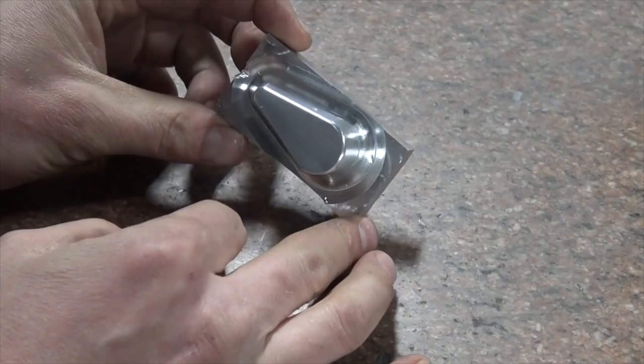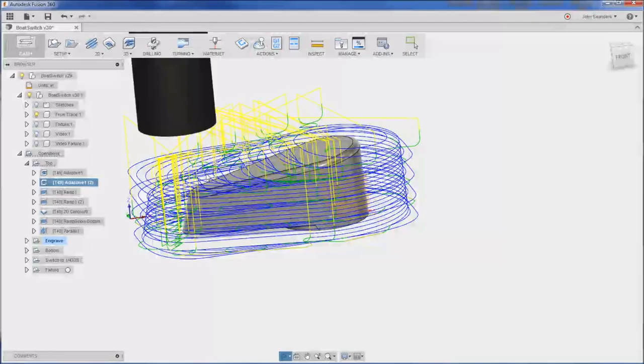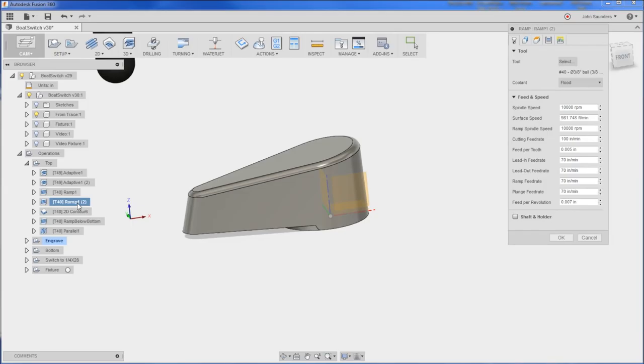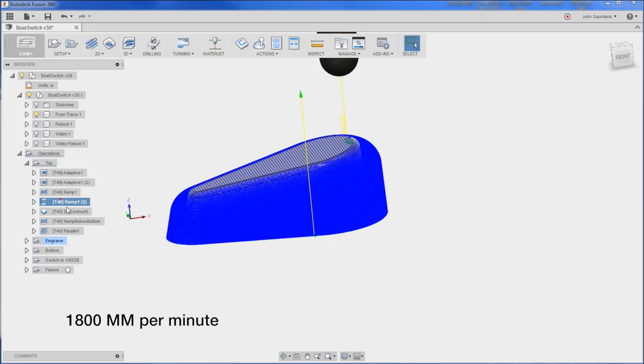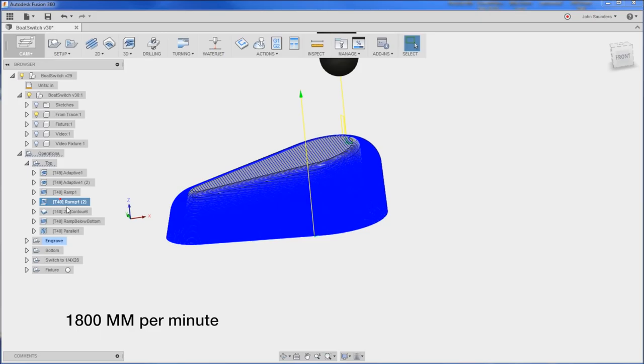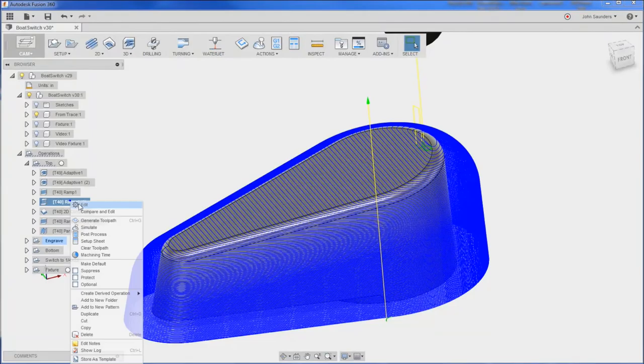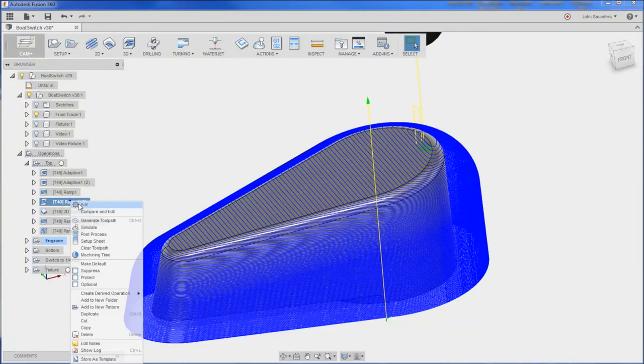A couple of the CAM strategies — folks were asking what we used and we got a great finish on our Tormach 440. We did a facing operation to rough off the top leftover raw material, a roughing pass with a shear hog to remove the bulk of the material, then two ramp passes: the first roughed out the part, and the second went much faster since most material was already gone — 70 inches a minute. We did a 2D contour because we goofed — you can watch the video for that. Then a parallel pass to clean up the top, which honestly wasn't even necessary. Total cycle time was 33 minutes but it could have been probably 15. The last parallel was only four minutes; the two ramp passes were about eight minutes each.